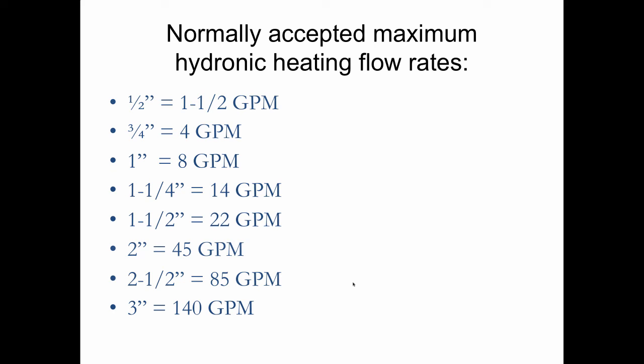And the 19 years I worked for the pump rep, I did that probably thousands of times and never got a pump back. And if I was looking at a pump curve and there's one that's bigger and one that's smaller, not the exact one I want, I would consistently pick the smaller of the two. And again, it worked every time. So there's a quick and dirty way of sizing circulators for existing jobs when you don't have all the information on what's going on. You don't have the original building plans.